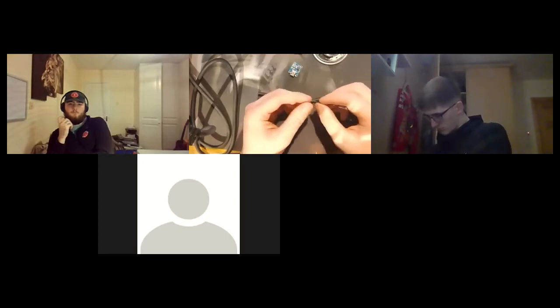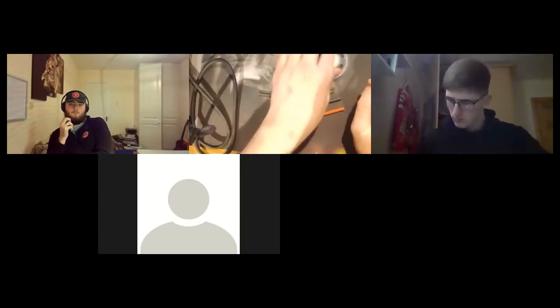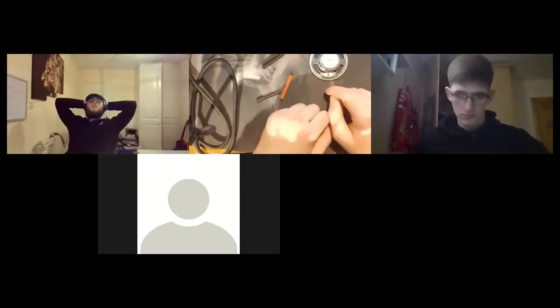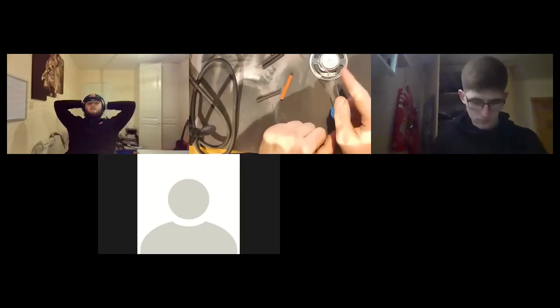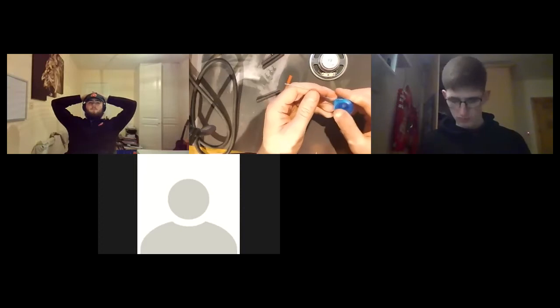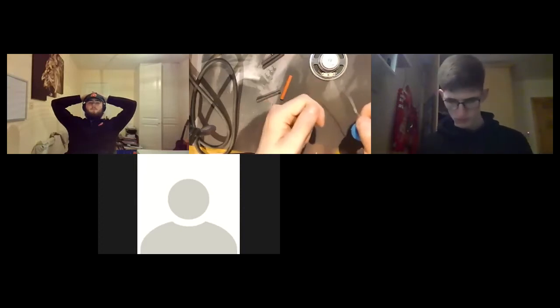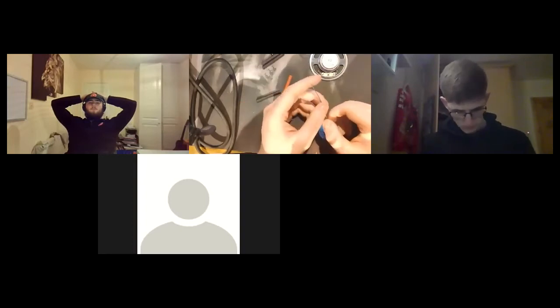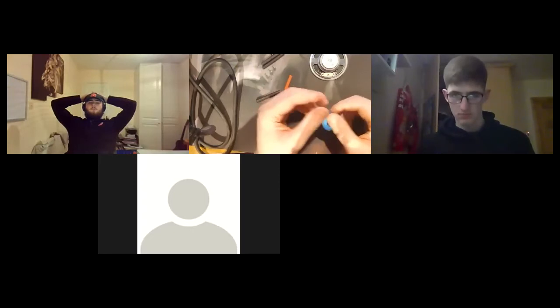I might only solder one. We'll see what the star is. I'll just solder the speaker for now. To start, this is solder. All of your kits would have come with solder. This is my own. The solder in your kit is flux core solder. Sometimes when you're soldering older stuff, you'll need to apply flux to stop it from sticking to itself, but you shouldn't need that if you're using the one that came in the kit. Flux core solder feels a little bit thicker, sometimes.